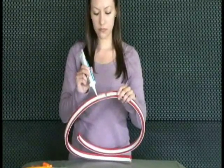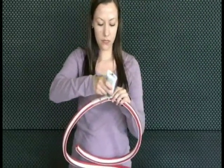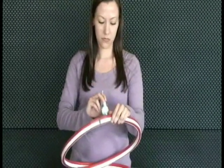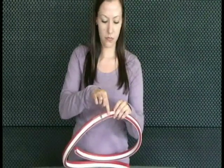If the application is to be placed outdoors, place a small bead of silicone around each end of the heat shrink tube and smooth the bead to ensure even contact. Your splice is now complete.